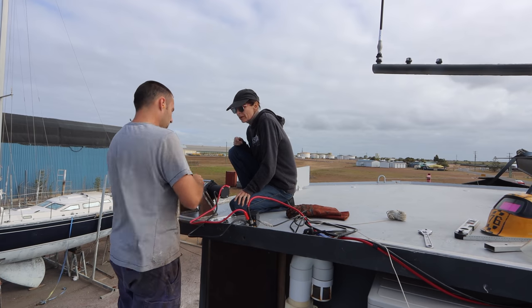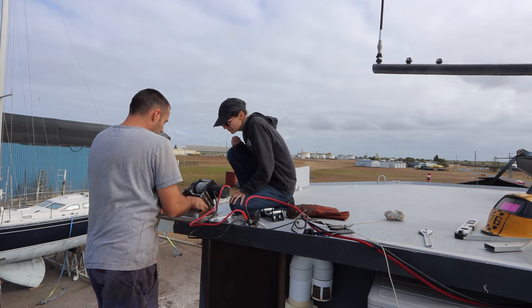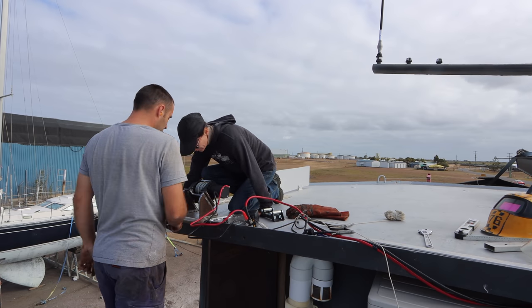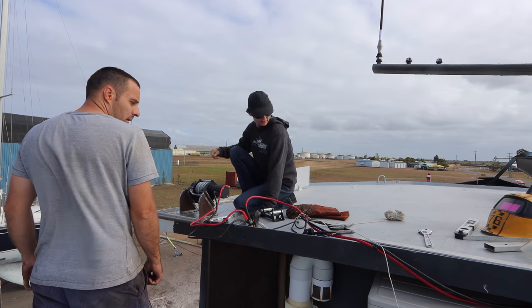Okay, it's tacked up, I just need to go through and weld it. But I've got to buzz this off so I can weld onto the doubler, get rid of the paint. Oh yeah, and I need to swap the flux core. This is all just tacked with stainless wire. Would you want me to buzz it off while you change the wire over? Yeah.